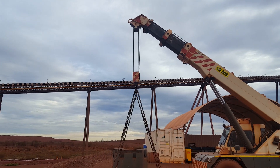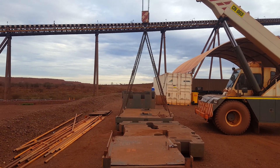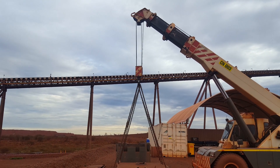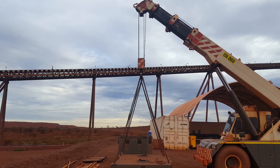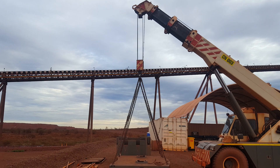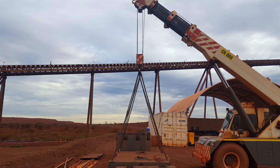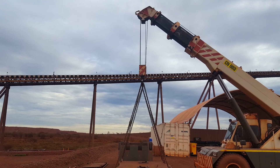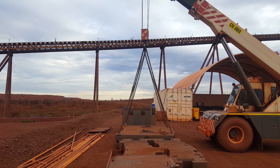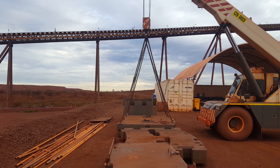After that it's all up to the crane driver. Because on his computer he can keep center — when he brings up weight the boom comes down, so it goes over center, but he sees that on his radius so he can correct it. So your job as a rigger is to get him centered, and that's it. Don't start correcting him once the boom goes over, or if he comes up on the winch and it goes over or under — that's his job, not yours.